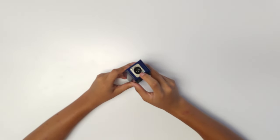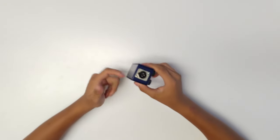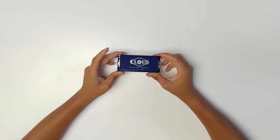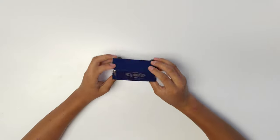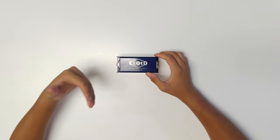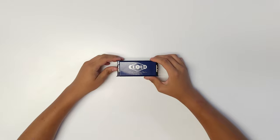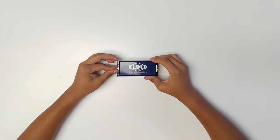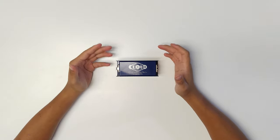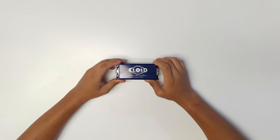You can see one XLR input on one end and a female XLR on the other — you just push to remove it. There's no power button or anything like that; you simply hook it up, let it use the interface's phantom power, and connect it to your microphone. As long as your microphone doesn't require phantom power — or can run on battery — this will work.